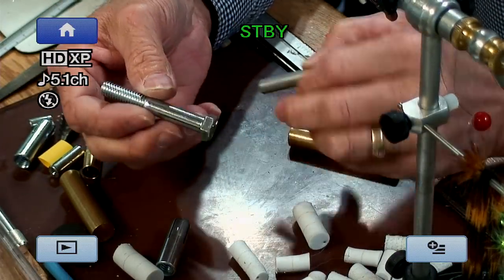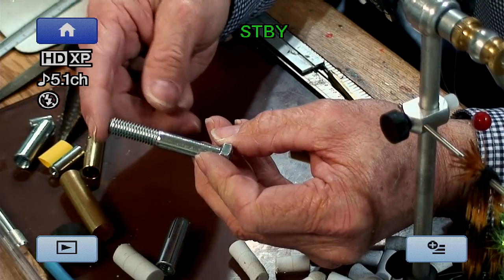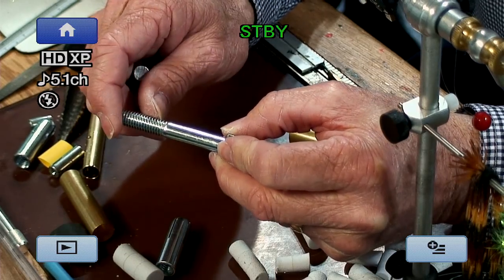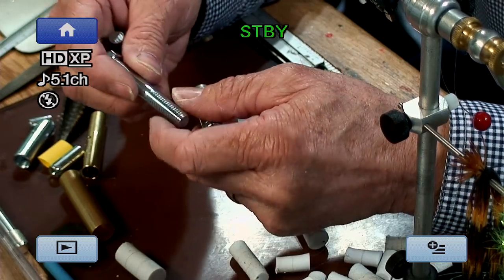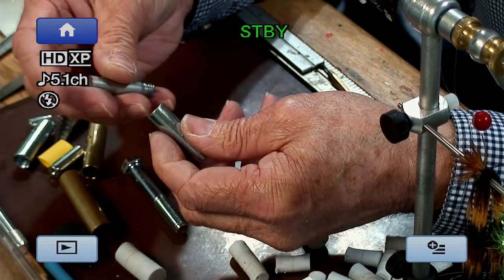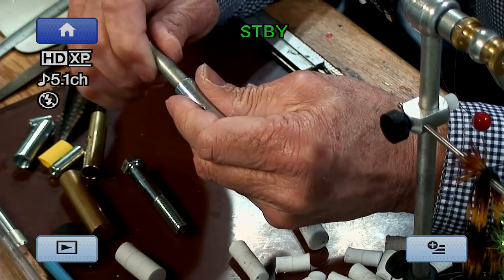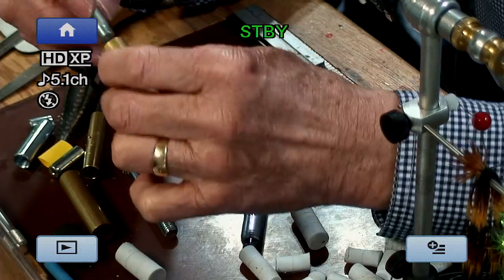The reason I use these is they go right inside my drill. All I did was take a standard bolt — this is a 3/8-16, about two and a half inches long — and I cut off enough so it won't bottom out inside. I actually want the taper on the end to bottom out inside that drop-in anchor because it will force it to center perfectly.